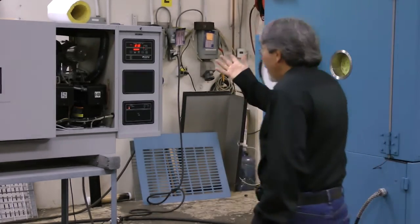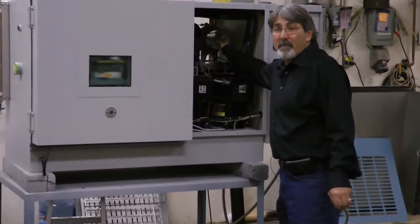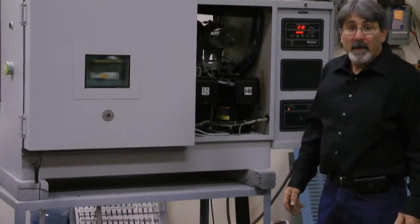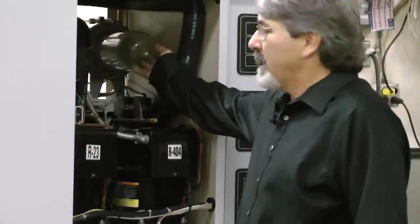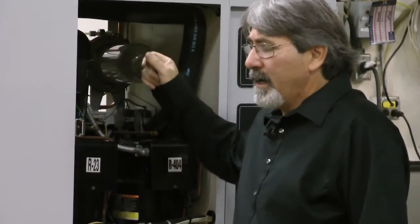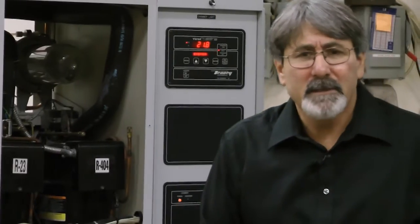We'll fill the boiler and check the boilers. We make sure with glass bell jars you're able to see that they're clean — that's one of the processes we do before a paint. In addition, if we find that it's cloudy and we don't like it, we'll typically pull the glass bell jar and put it in a cleaning solution. The same thing with enclosed systems — for example, this one — where during our checkout we've actually had to pull the humidifier, soak it in a solution, and open it up to make sure everything was clean.